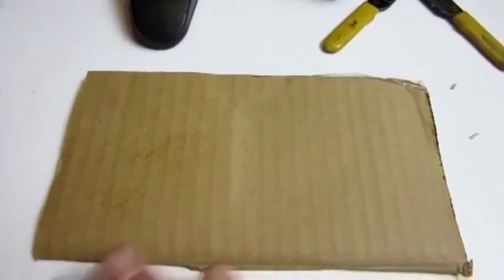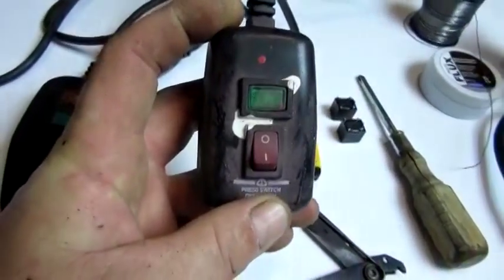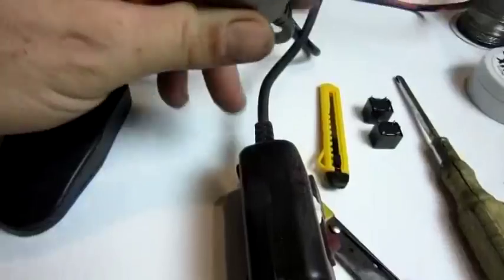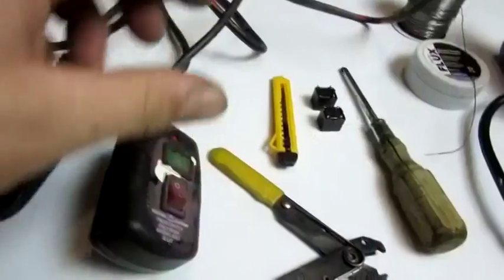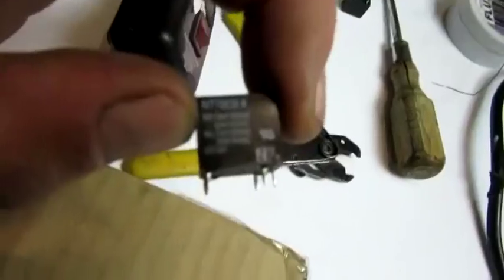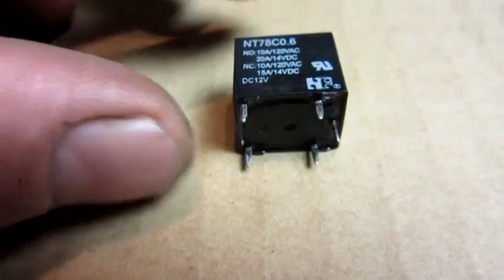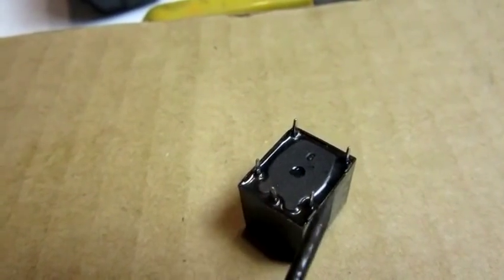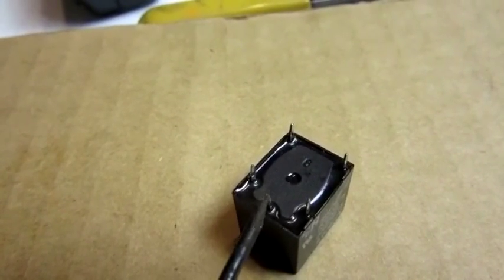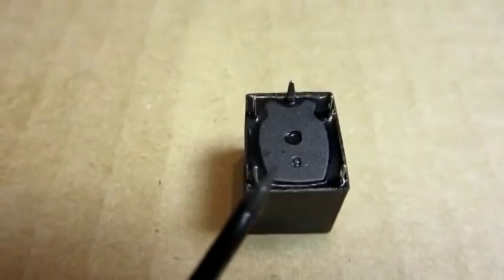I always solder wires on top of cardboard. You hook this to a fog machine and it has that plug on it. When the fog machine's ready the green light will come on and you push the button. By simply adding a relay, you can activate your fog machine with a haunted house controller, DMX, or whatever you like. This is a 12-volt DC relay, but you can activate 120 volts with it. On here you have positive on one side and negative on the other for 12 volts. The center terminal is the wire you're going to break — one side is normally open and one side is normally closed, but we have to check it.